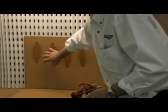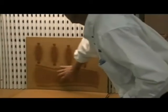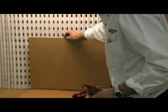Really, the pattern looks really good. We got a nice full wet center, and then the two tails on each side. The tails you're always going to see when you're spraying with Air Assist Airless because we use the atomizing air to draw the tails out. So we'll just do a quick pass to see how that looks as we go along. And it looks really nice. It's a full pattern. So now we can flip our test board around, and we're going to bring in the atomizing air.